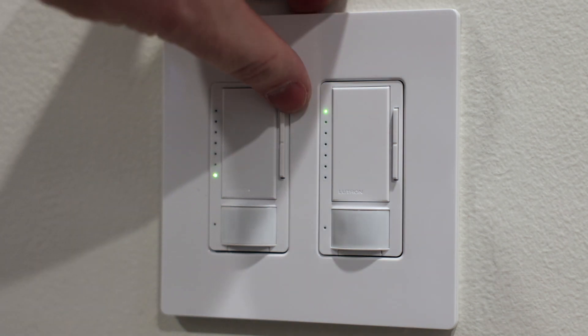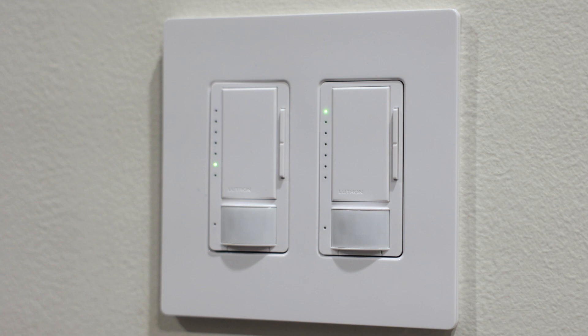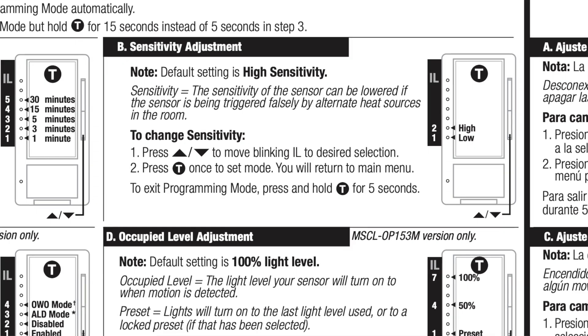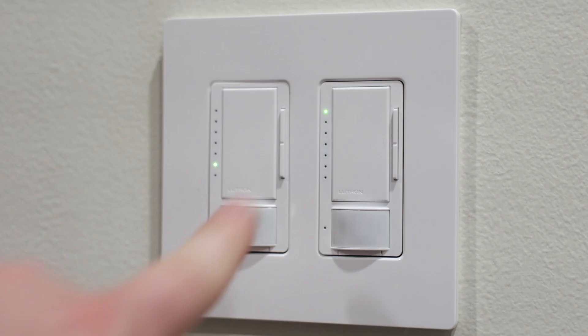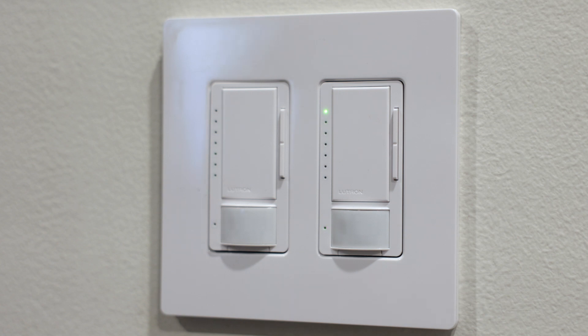This one is the sensitivity adjustment. If I click this again, I can set it to low sensitivity down here, and the motion sensitivity will be very low. If I want it to be high I would set it on that one. In most cases I have it set to high, because that's kind of the whole point of a motion sensor light switch — if there is motion, it should turn on. But if you don't want it turning on when you turn the page of a book or something like that, you can set it to low. I'll go ahead and lock this back in at high.